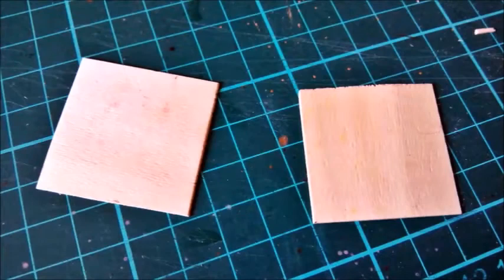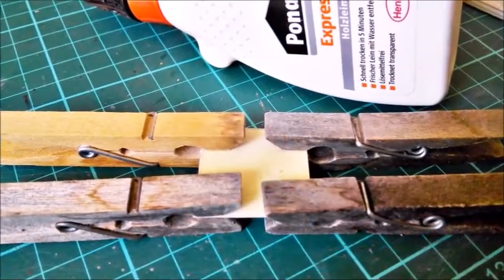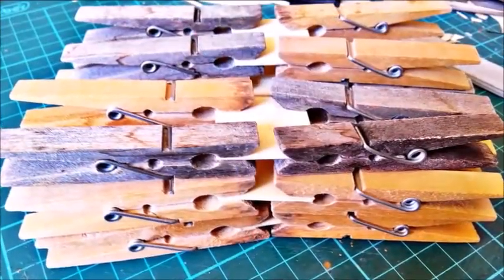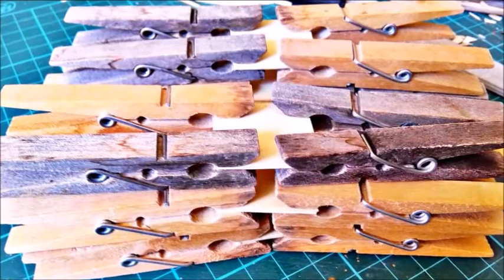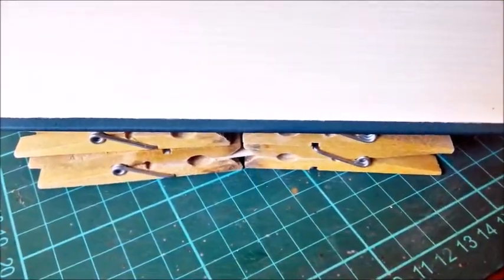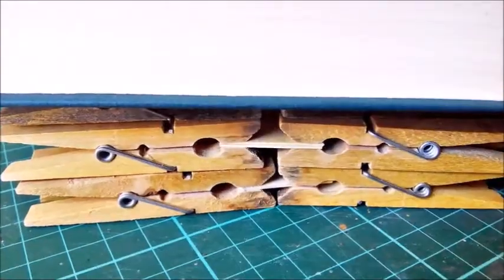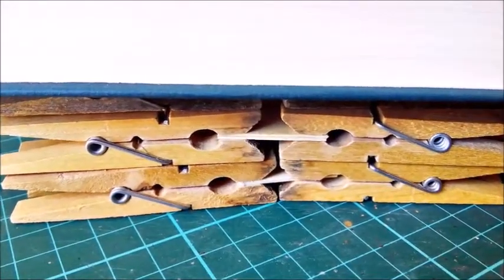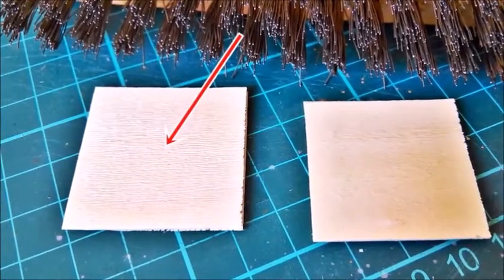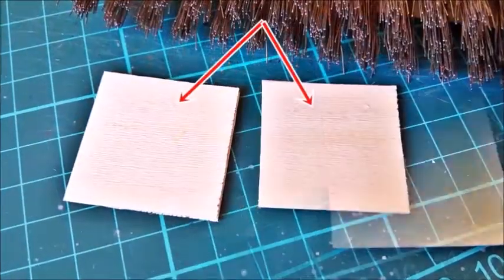one day later, I really had a plan on how to build the rims. Veneer was the right material, but to give it enough stability, I had to make my own plywood. Two pieces each were glued together crosswise. Great literature put enough pressure onto the soft veneer. Poplar has a rather faint wood grain. The wire brush made it visible, as you can see here.